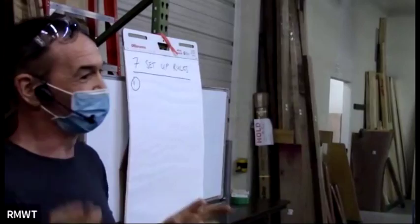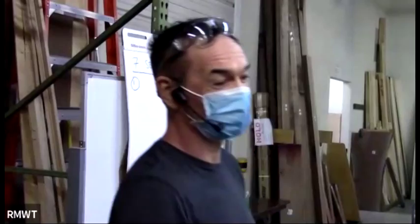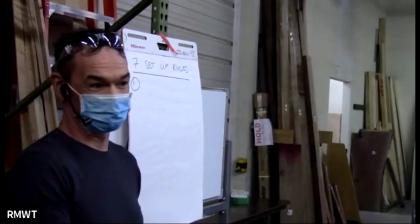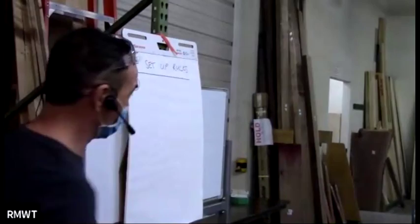I don't care whether you're turning Delrin or you're turning PVC, they have huge problems. And also, I noticed that I got a little bit sick from it. If you turn enough of it, and I turn hundreds of pieces, they gas off. So you have to wear a different kind of respirator, because this kind of mask or an N95 doesn't work, because it's a gas. It's not a particle. So I was affected by PVC. So be very careful with that stuff.